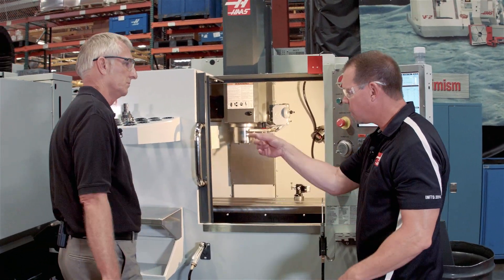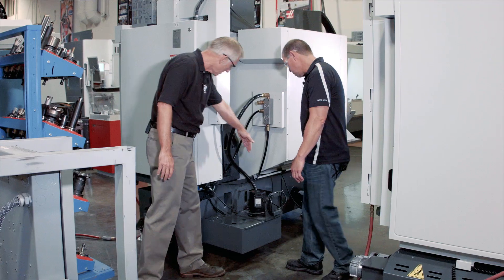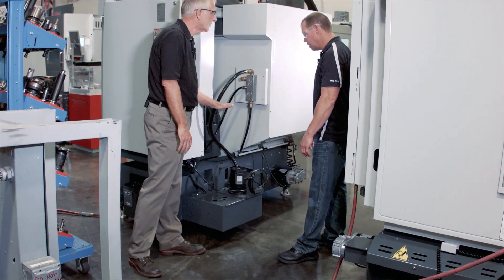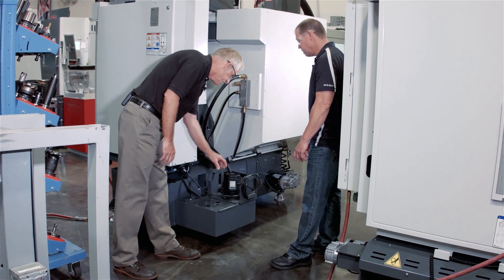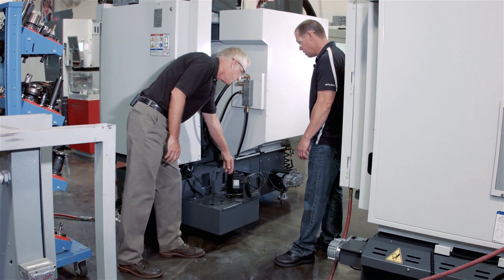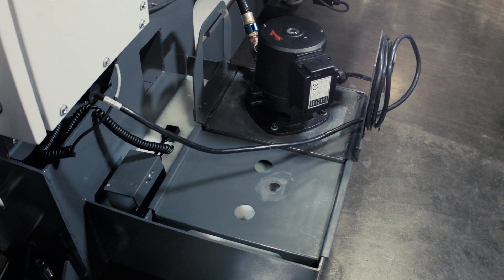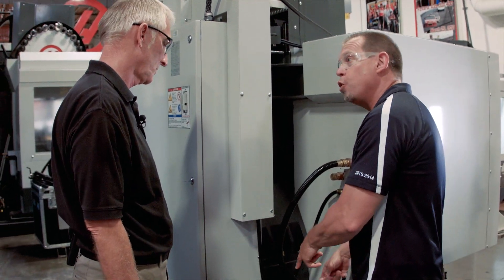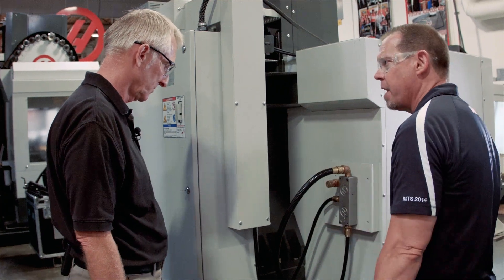Talking about coolant, let's go around the side of the machine to take a look — you guys have actually redesigned this whole section as well. What we did was we brought the back of the tank out, dropped the bottom a little, brought the coolant level up, and that's how we doubled the coolant volume. And that allowed us room to put the standard tank here with a TSC side by side, or pop in our standard high-flow tank right off our VMCs. When you do add TSC, you drop it straight down — you don't have any sheet metal in your way, nothing to worry about.